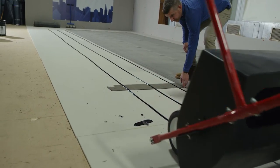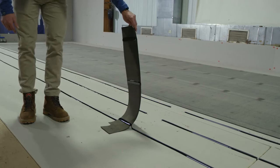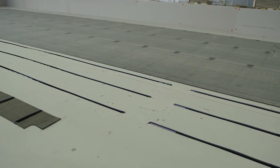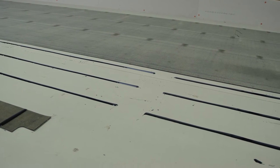Every square of material, you want a six-inch pre-determined break where the adhesive won't be. We pre-cut some membrane there and laid it down, and we're just going to take it away now, which creates a cross channel for moisture that might be trapped underneath the membrane to move both perpendicularly and laterally along the membrane.